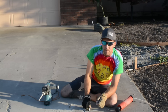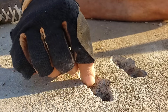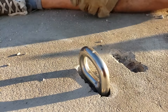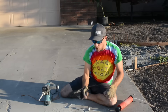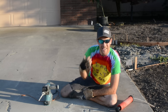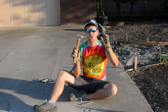If there's dust in there, your glue won't stick — so keep at it until it stops being dirty. If the hole is too deep, what you can do is take one of these little pebbles and set it right there on the throat to hold the bolt up right where you want it. When you fill it up with glue, that pebble stays there and holds it in place until the glue cures. Our hole is perfect for the glue-in now. We don't have to notch this if we're just using a mechanical bolt, because those have climbing hangers and climbing hangers don't need notches.